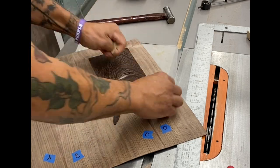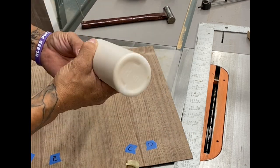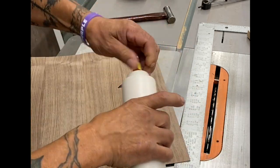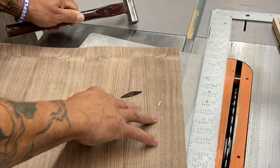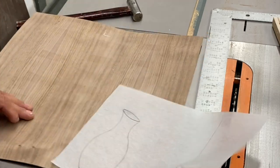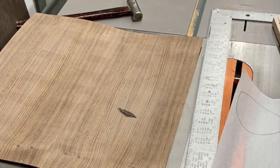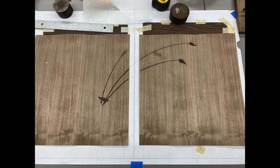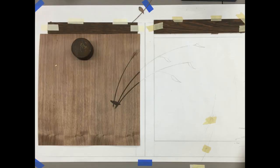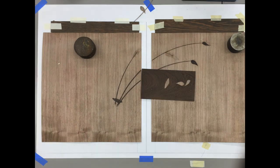The reason I'm using a scroll saw instead of a fret saw is because the fret saw has a limit of about 11 or 12 inches — that's the depth of the frame on the saw — so I had to use a scroll saw for the entire project. Here I'm just gluing in the first piece. It always feels amazing to get the first piece in — that's the inside of the vase at the top. When you start a marquetry pattern, you start with the pieces furthest away from the viewer. Here I've got that little piece inside the vase, and I can do all the stems. The main part of the vase goes in last because that's closest to the viewer, and it cuts out the wild area left by earlier pieces.